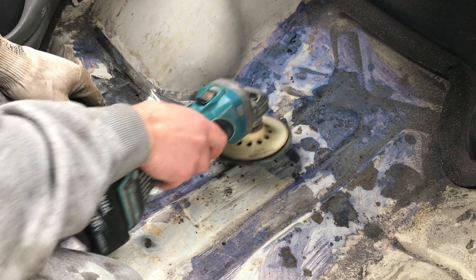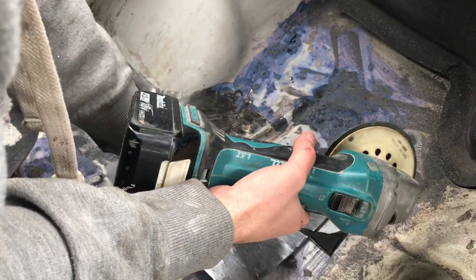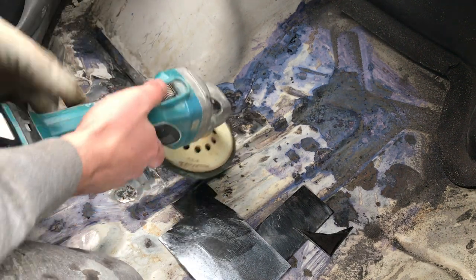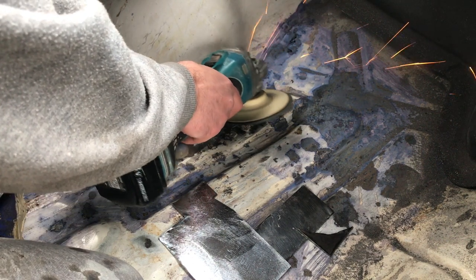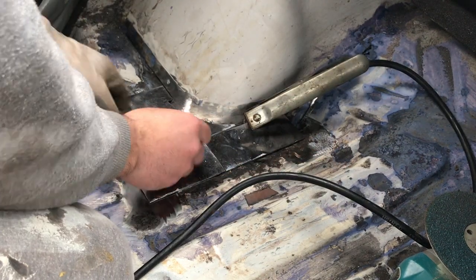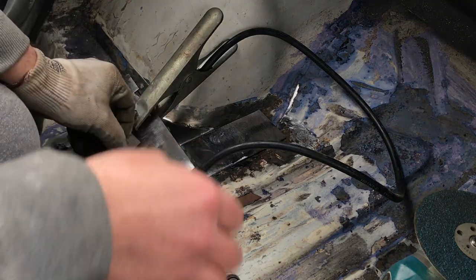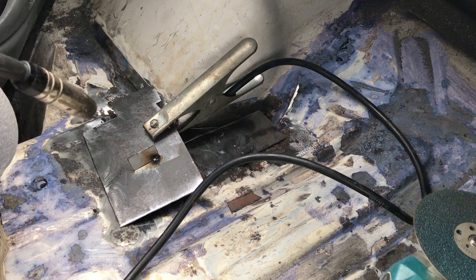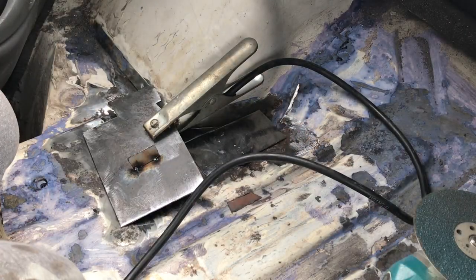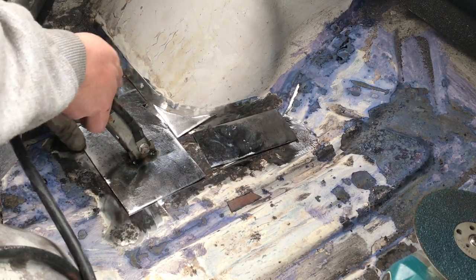So I just need to clean up around the edges where I'm going to be welding now. I'm not an expert welder but I can weld and I get by with what I've got — it's nothing fancy, just a gasless welder. I know they're not the best but it does a job. I need a good earth to put my earth clamp on, so sometimes what I like to do is just get a little scrap piece of metal and make a little tag for my piece, put a few tacks in, and then I've got a nice base for my earth clamp.